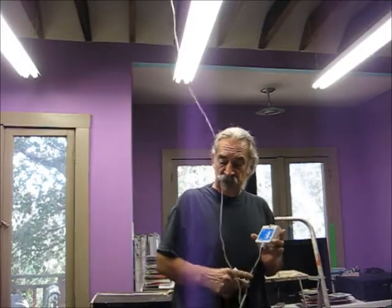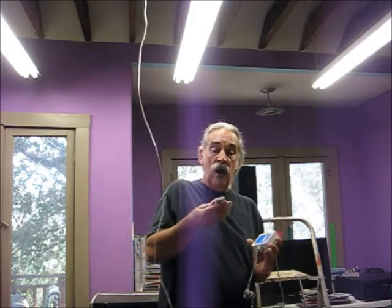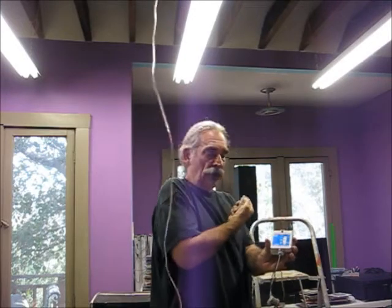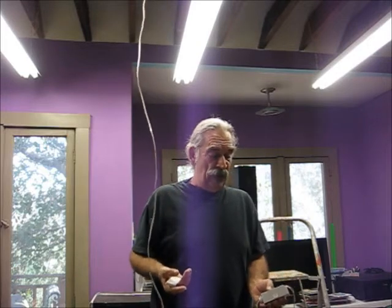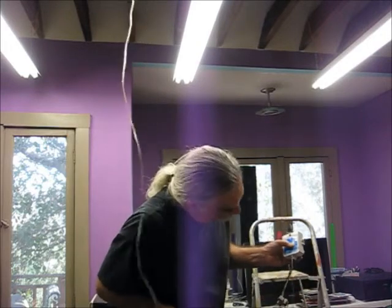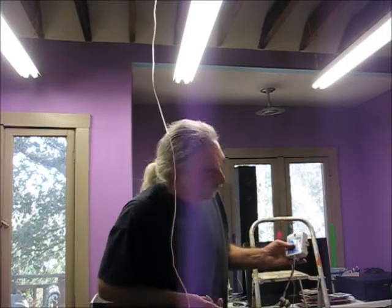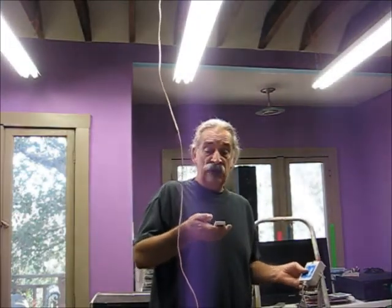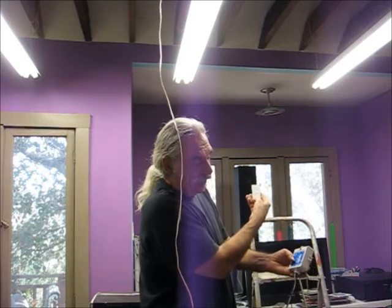Our system is initialized, but we don't have any switch association with the lamps — this Pico switch is not going to do anything. So I'll go through the button push: you hold the center button down on the remote until the ClearConnect light begins to flash, about 6 seconds.